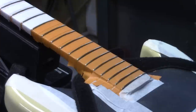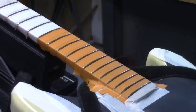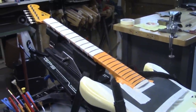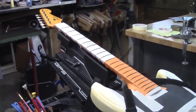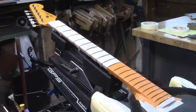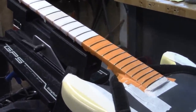So to answer the questions, there's a couple of subscribers that said, oh, you didn't mask off the fingerboard. They were referring to the last couple of rosewood fingerboard Strats. In the case of a maple fingerboard, you definitely mask it off. But I find with rosewood and ebony, as long as you don't have some super elaborate or plastic inlay, like in Les Pauls, if you feel you want to mask it off, knock yourself out. But I really don't think it's necessary in those cases. By contrast, in this case, it's super pivotal.